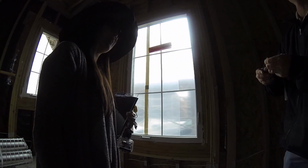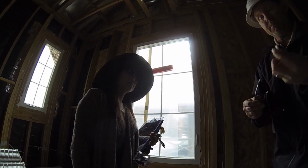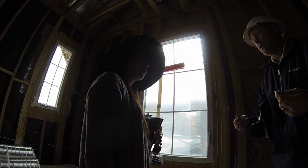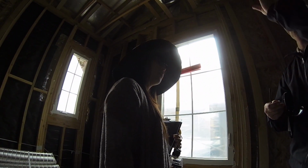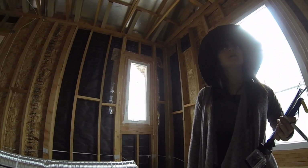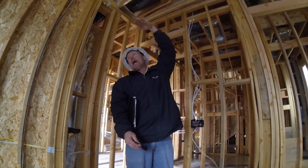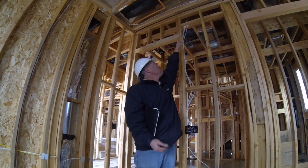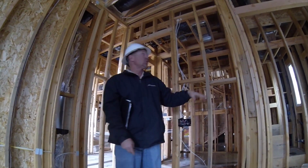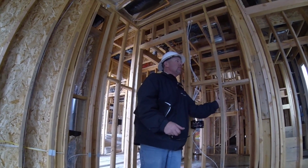So anyways, this foam right here, I'll just grab this piece. We spray this in a lot of the grooves and the cracks and all the little holes, and it serves two purposes basically. For one, we're trying to fireproof your house the best we can. It air tightens the holes, so if a fire starts in this wall right here, we don't want that going up into your attic. While this stuff isn't fireproof, what we're hoping is it'll smother it, so it's stuck in this wall and dies out before it goes anywhere.